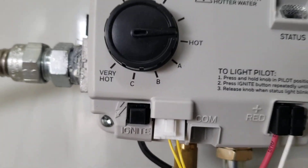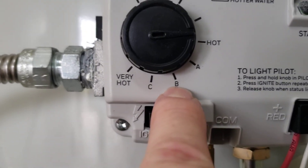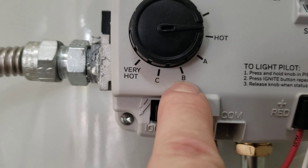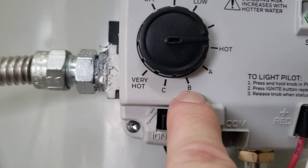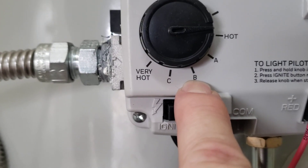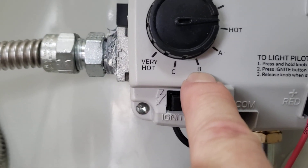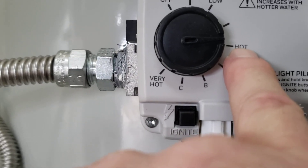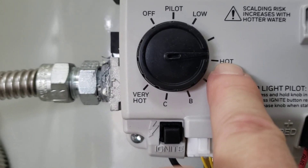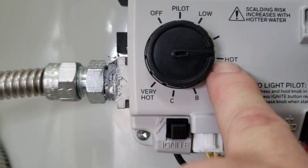At 140, which is what the CDC recommends, you'll produce hotter water, which means you'll use less hot water at each fixture, so this will feel like a 65 gallon tank. This is a 50 gallon, so you can do that, but scalding risk increases — it's three seconds and you've got third degree burns. This takes about a full seven minutes at 120 degrees. I like it at about 110, which is probably right around here, but we leave it at hot for liability purposes.